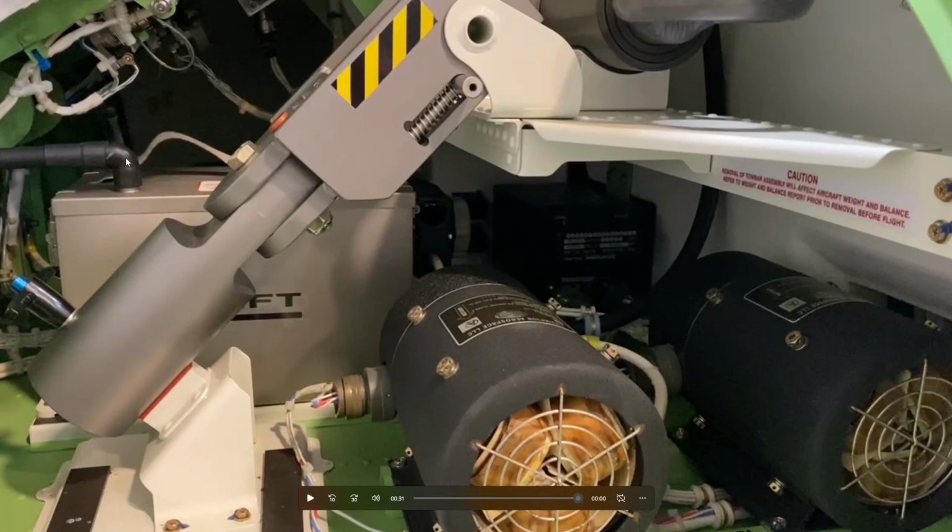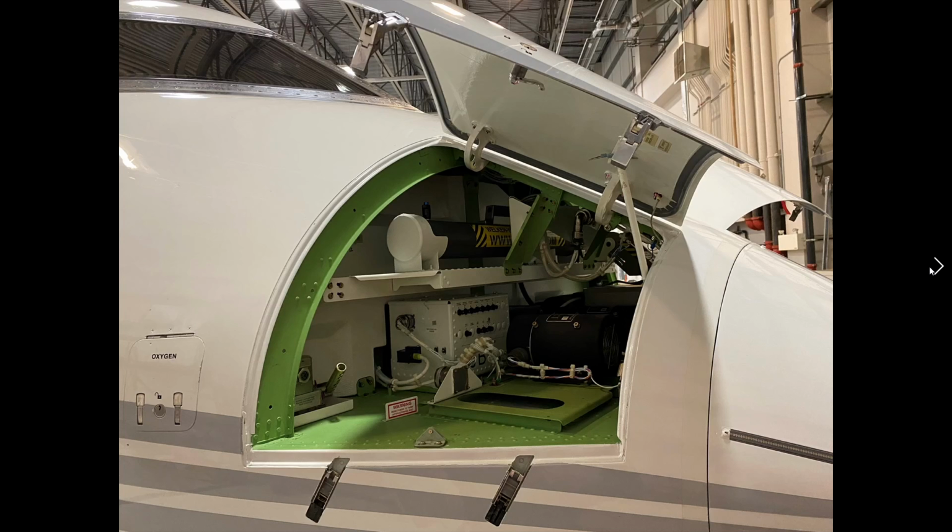All batteries on aircraft are all vented. So this is a vent for battery acid gases and that kind of thing to be vented overboard the aircraft and definitely not into the cabin. There's a whole bunch of sensors that are on this battery as well. And we want to ensure, maintenance wants to ensure that this battery is in top shape at all times. So we disconnect it for every single flight after we're done, the two batteries, this one and the one in the aft equipment bay. So here's now the other side, and there's quite a few slides here.